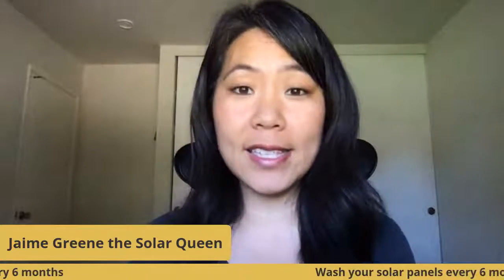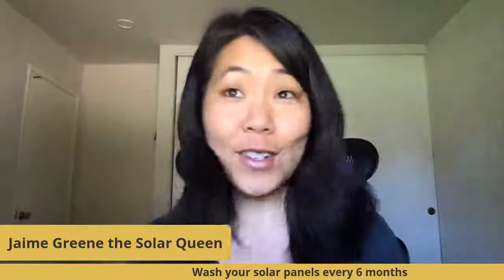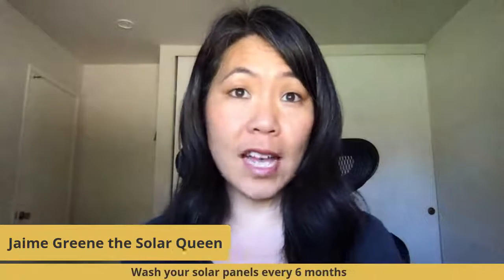The first tip is to wash your panels every 6 months. That might seem like overkill, but that's typically what they say in the solar agreements. So if you've had your system for a while now, you can even stand from the ground with some pressurized water hose and spray them down. But do not do it on 100-degree temperature days or even 90 or 80. Do it when the outside temperature, the water temperature, and the temperature of the panels are the least differentiated. Meaning if you can do it in the morning, on the weekends, do it in the mornings.